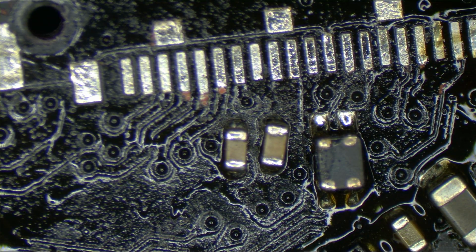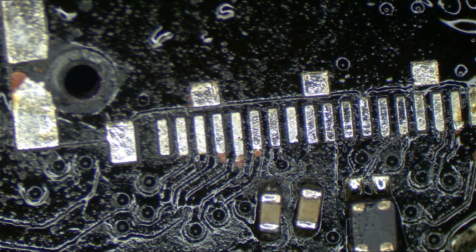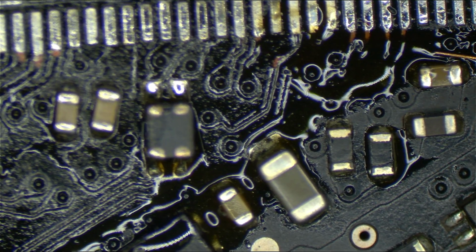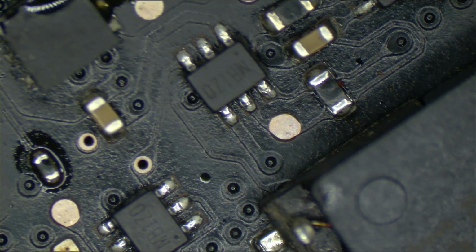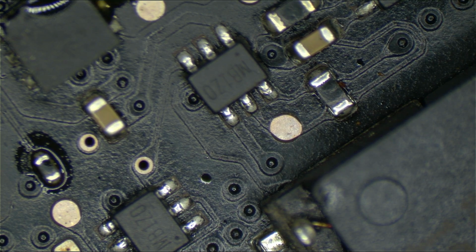Okay. Oh, and I also accidentally got the LCD connectors that don't have those little hooks, so I got to align it manually. So you see how there's holes by the LCD connector, like the upper left corner over here and here. So for the newer boards, they have these LCD connectors that I love that have those there so that you don't have to do any work in aligning it. It just kind of aligns itself for you. And I'm always for somebody else doing the work. Like I don't see there to be any reason for you to do work when something else will do it for you.